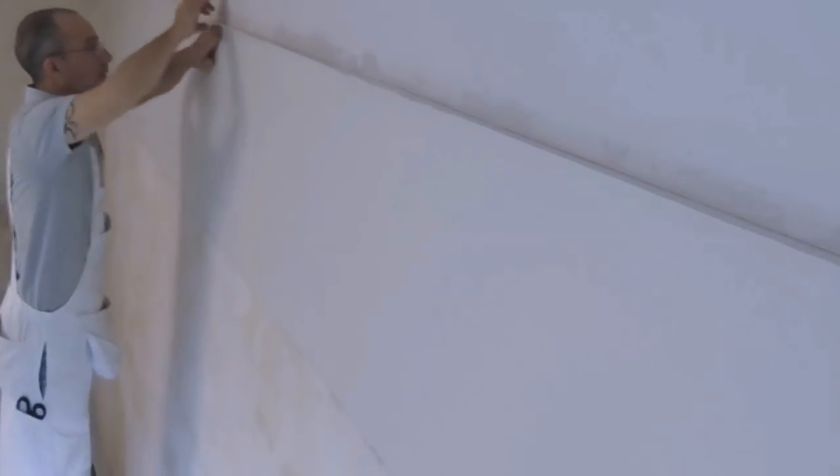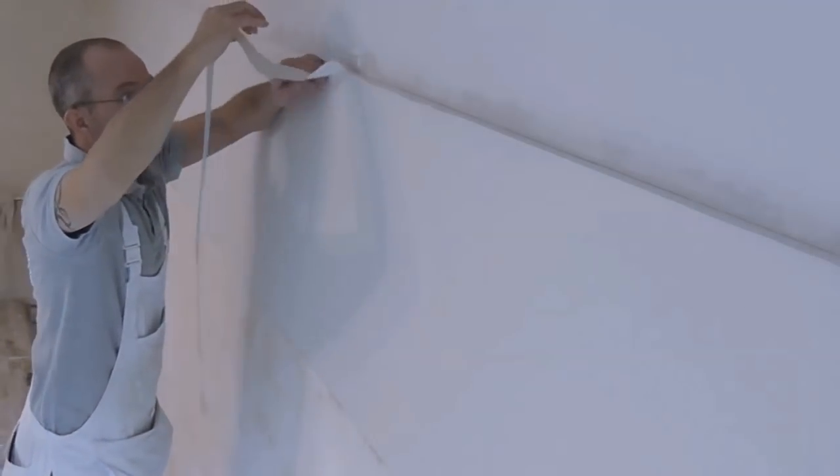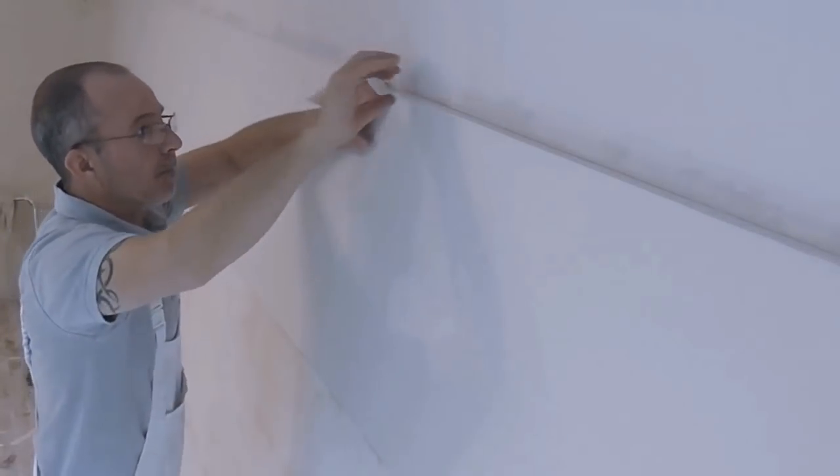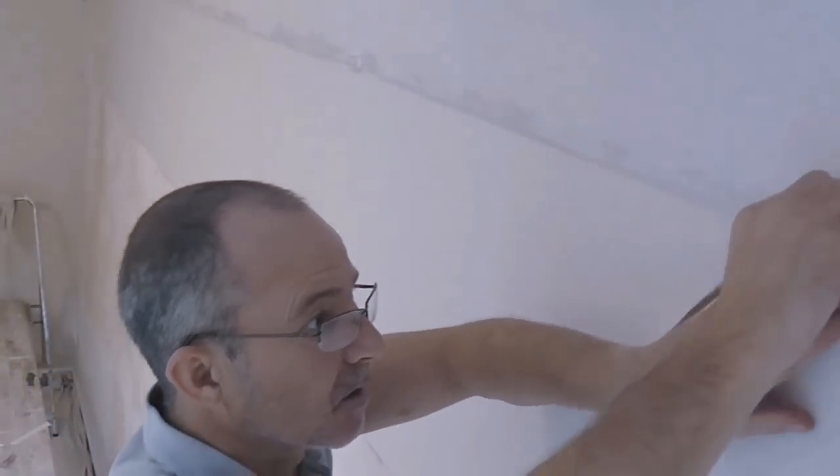That's not cut too bad at all, but I'm not just going to pull at it because you could tear the paper. In some places it's just holding on a little bit, so keeping my hand on the paper on the wall and just pulling it straight out. Again, it's not easy cutting wet paper. That's why I prefer to use scissors when possible. On any finished paper, I just really do like using scissors. They just leave a lot better finish. There you go.